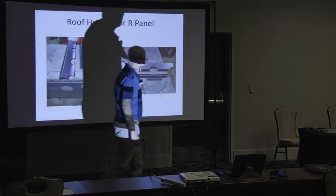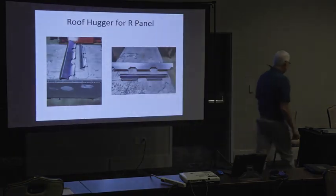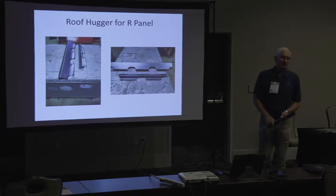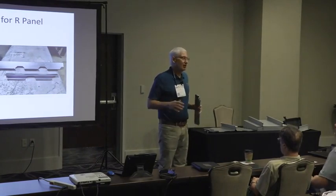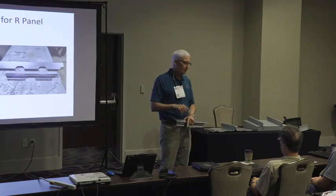So what I can tell you is that my experience now is that when somebody calls me about putting a new roof on their building, I used to think what they wanted was the cheapest thing, which is basically a tall clip. You use a clip that holds the new roof above the old roof, and you attach the clips into the purlins. You've got to have a clip that's tall enough to do that. That's the cheapest way.